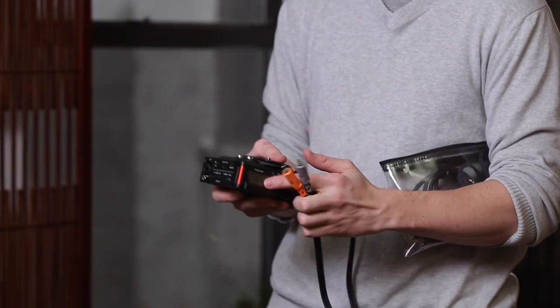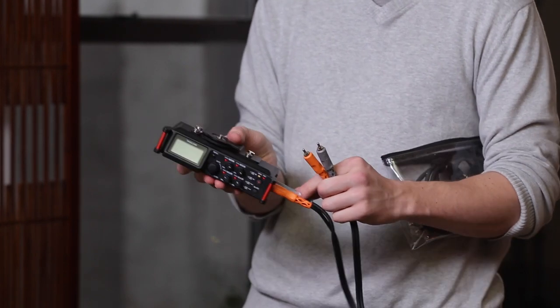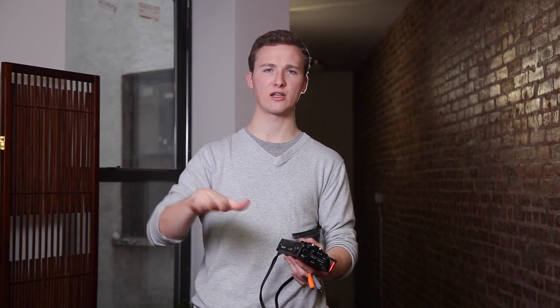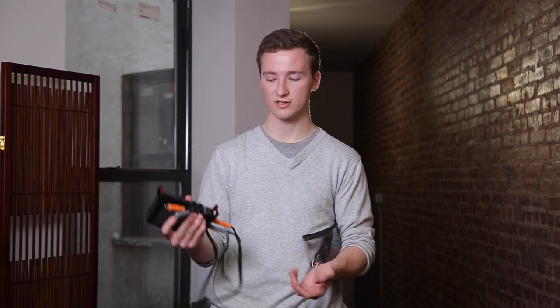And actually with this Tascam, you can double that even more. For each input, you can have two different levels. So technically, if you adjust your knobs right, you can have four different levels for one input. So there's zero chance of you peaking. And at receptions, the DJ's levels can change like crazy, whether someone's talking into the mic way too loud or not. So I definitely like to have that backup option. There's no reason not to. So I love this device.